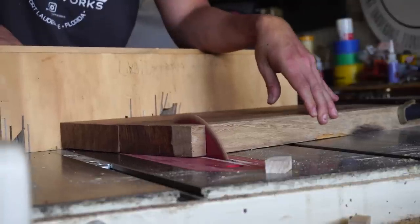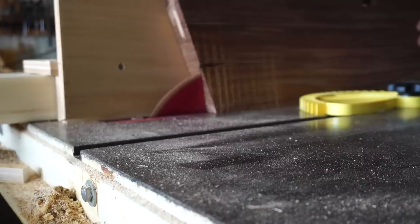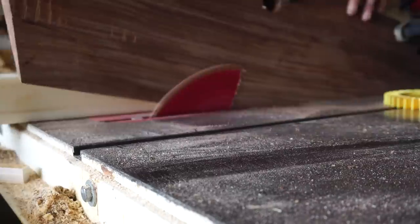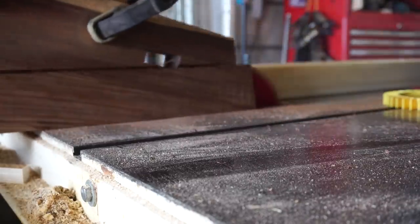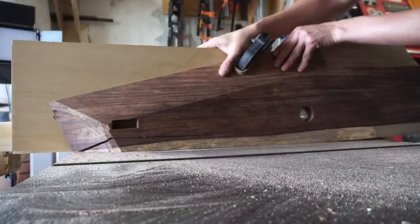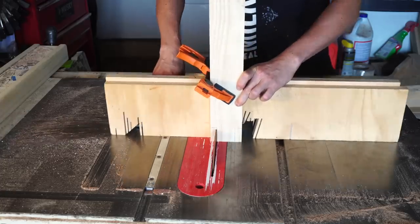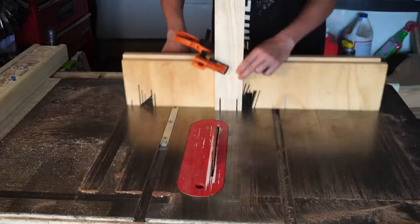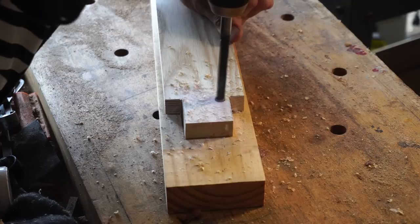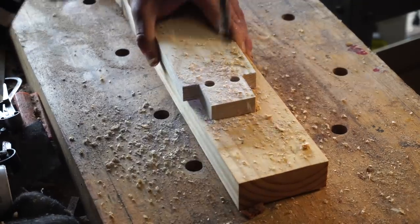And then I'm going to shape the entire leg on the table saw using some huge bevels to just provide some interesting embellishments to the vise itself. The parallel guide is made from ash, and I cut the tenon itself on the table saw before drilling holes in the tenon to allow for the wedges to be driven in and flex outward.